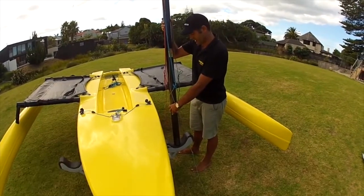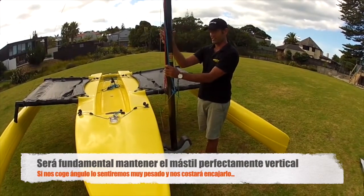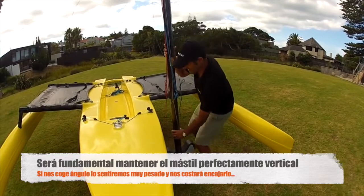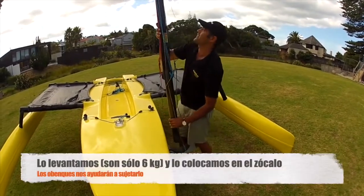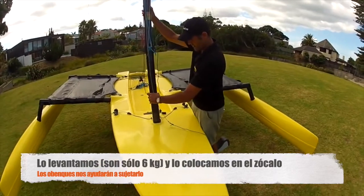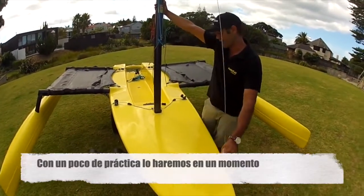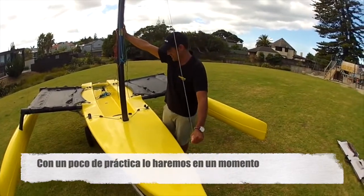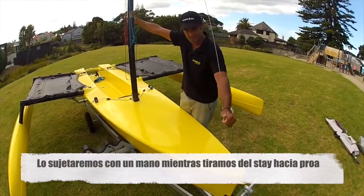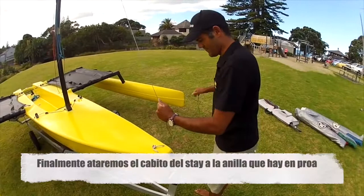Get a nice wide grip on the mast and put it up onto the trailer support. Readjust your grip, then put in the mast step. It's really key to keep the mast vertical — once it gets on an angle it becomes heavy to lift. Lift it up, the stays will tension, watch the base and put it into the step. It takes practice but shouldn't require huge strength with the right technique. While supporting with my right hand, I grab the forestay with the other — and now we're ready to lash it up.